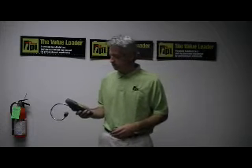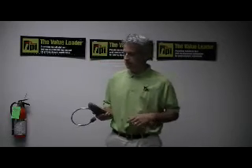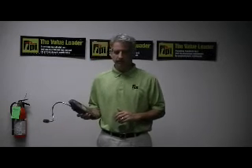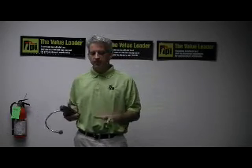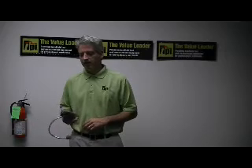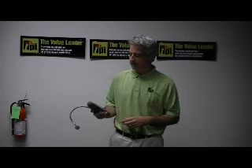What's nice about the thumb wheel is if you're actually on the job looking for a combustible gas leak and you want to zero out the leak, you can be moving along your pipe or wherever you're looking for the leak. The alarm will fire off and you want to move that thumb wheel clockwise to decrease the tick rate. Then we know that that particular saturation of gas is now null and void, meaning unless that concentration increases, we won't hear the instrument fire off again. So if it's finding the same level of a leak it's not going to fire off, but as you go closer to the leak source it will fire up again. That's how you can pinpoint your leak using the thumb wheel.